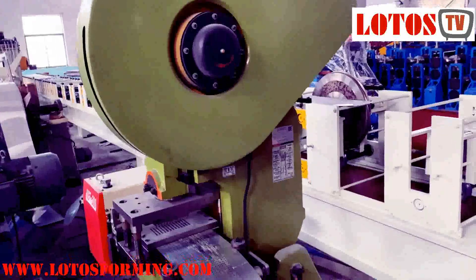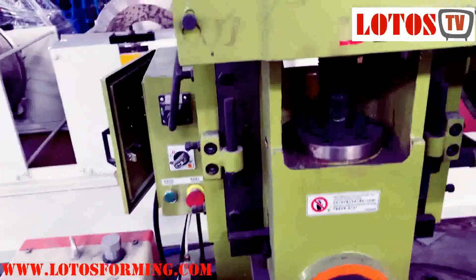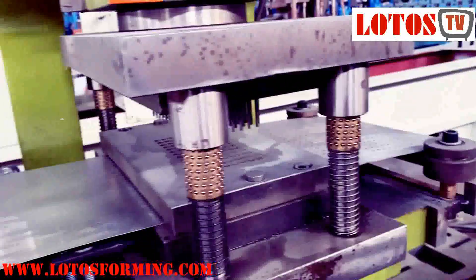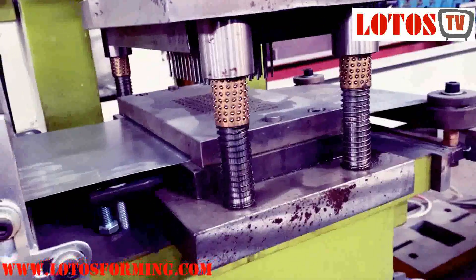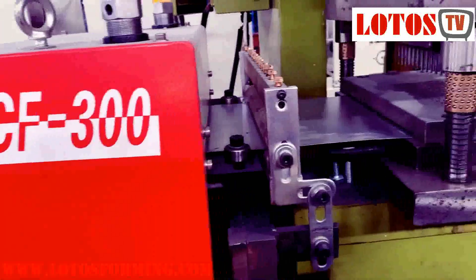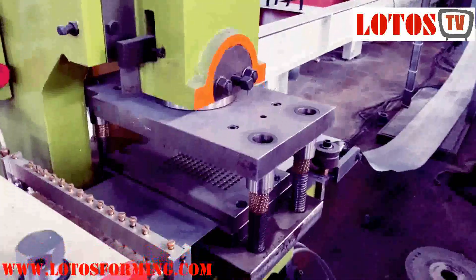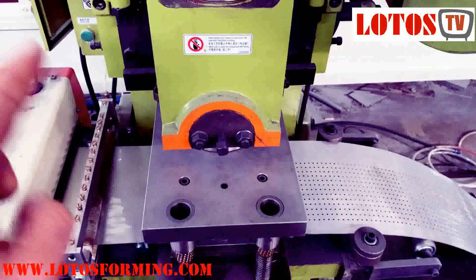This is also mechanical punch with perforated molds. As we already said, for continuous punching we use the mechanical punch — faster and more precise. You can see: before the molds, no holes; after, we have perfect holes. The molds have a lot of holes inside for column guides. Servo feeding adjusts the input material feed length. So everything is clear here — before punching and after punching.